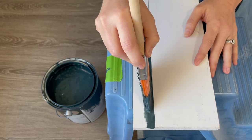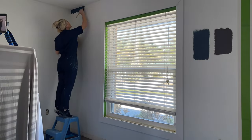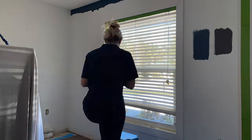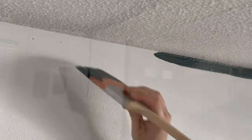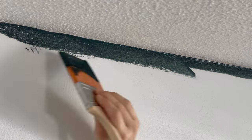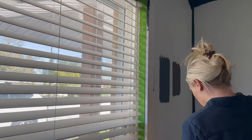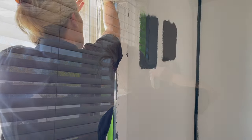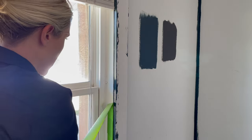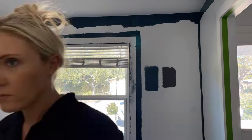If I see there's some excess paint I can just go back and pull down. Then I just pick a corner of the room and start edging along the ceiling, making sure to do a really thick coat so that we don't have to come back and do a second coat of edging. I do all the edging on one wall at a time — around the window and the baseboards. Even though the tape is here I am still trying to edge slowly and carefully. It's obviously okay if paint gets on the tape but I don't want loads of paint on the tape. As soon as I finish one area that's taped I immediately pull the tape off while the paint is still wet — if you let the paint dry and then pull the tape, it will pull some paint off with it leaving a jagged edge that has to be fixed.